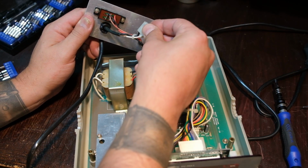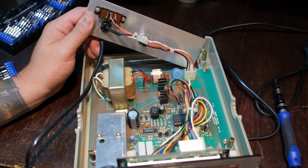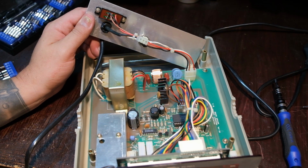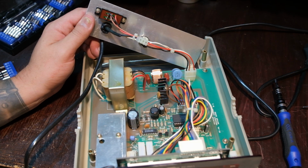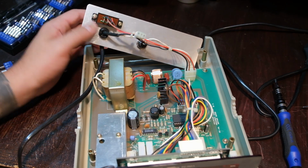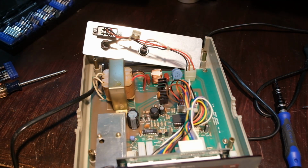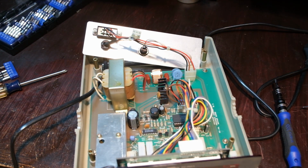I see a lot of these Molex. They are ubiquitous, I guess is the word. They're everywhere, and they're fine for some applications. I tell you what, you go to their website, and there are just so many variations. I mean, tens of thousands, it seems like. So I've emailed them before, and they've been pretty helpful, but you can use multiple types of contacts in each one for the different wire gauges, different crimpers. A nice mil-spec or worthwhile crimp tool is $400 or $500. You only have to buy it once, but for 2 pins, I don't think I'm going to make that purchase.